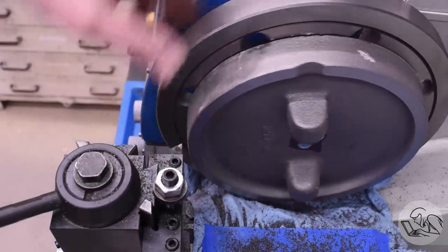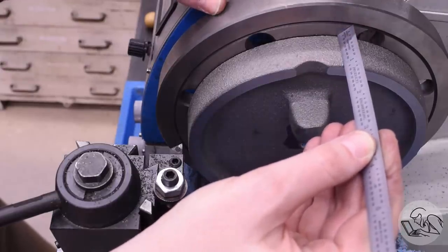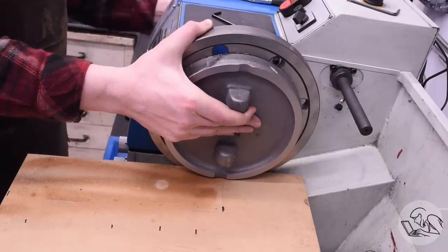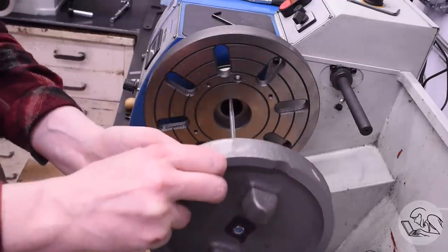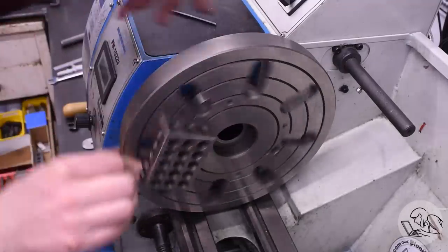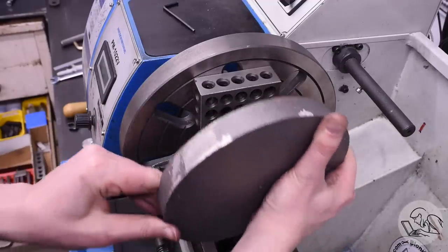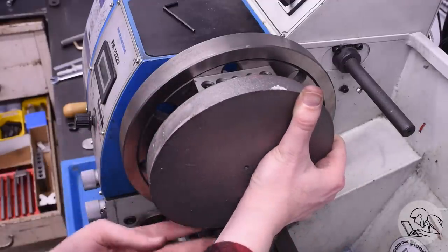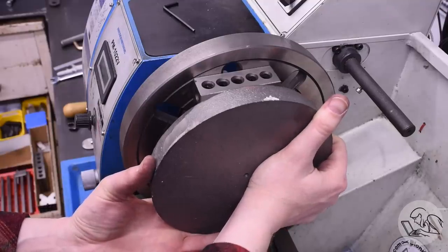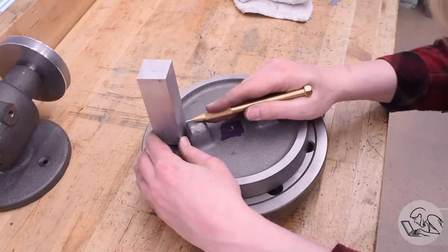I would like to remove more here because this table is quite a bit over thickness, but if I take any more off this edge it isn't going to look right. So I have to pull it off now even though I've just barely cleaned it up. The challenge now is to fixture it the other way on the faceplate, but I need to support it up above the faceplate to clear those bosses. My first thought was to bolt some 1-2-3 blocks to the table, but that won't work — they'd be in the way of the turning tool. I need something like that but sacrificial, so I grabbed some aluminum from the bin to make some little sacrificial spacer parallel blocks.